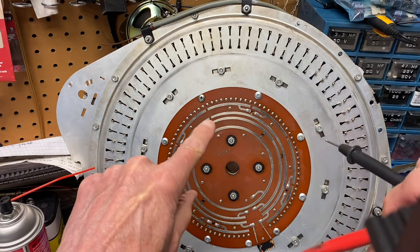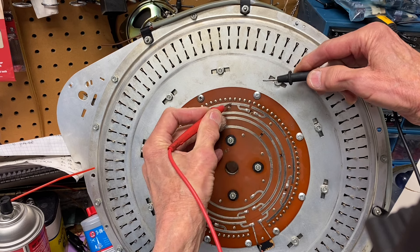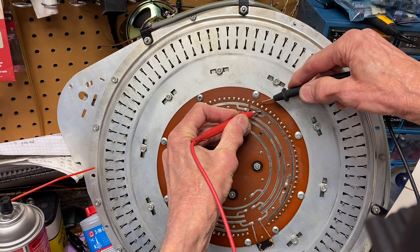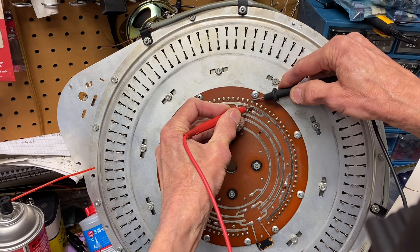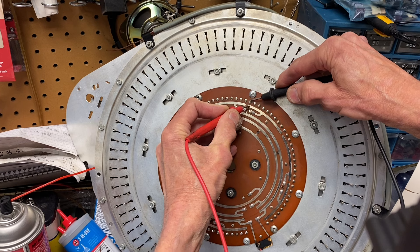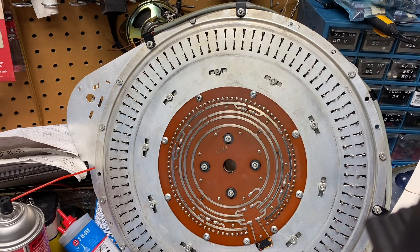If you're not sure there's power on your write-in circuit: when the write-in arm goes around, it has a bridged wiper between the DC that comes in on the segment board. There are eight segments, numbers one through eight, and each digit — A, B, C, D, E, F, etc. — so if you picked A6, the wiper comes around to that spot. Before the wiper arrives, if you check the voltage there, you should have negative 33 between those two points. When the wiper comes around and hits that segment and nubbin — boom, it stops. That's basically how you do it.